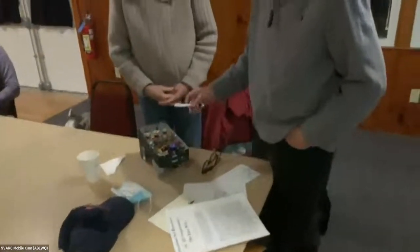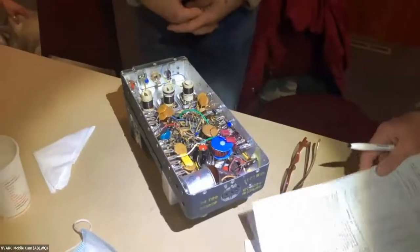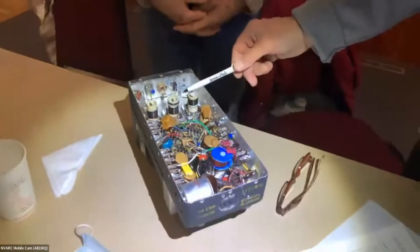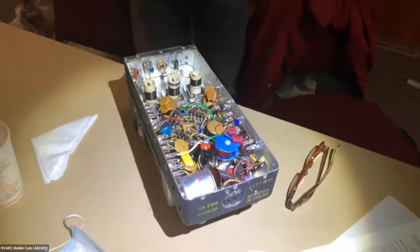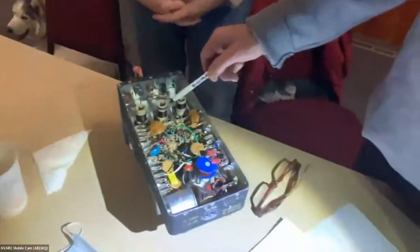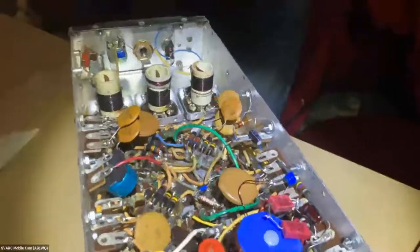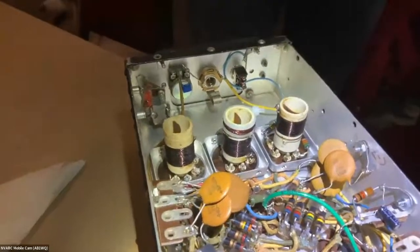The thing that really puzzled me was the RF coil. Initially this was a universal-wound coil — you can see that universal-wound coils have a honeycomb arrangement — and there was no way I had a machine to do that. So I said, well, inductance is what really matters. I used a couple of cable ties to form a channel and wound the same number of turns within it, and it came out resonating right about the right frequency. The original coils were wound with Litz wire, which kind of feels like a spring. That was the only universal winding; the rest were straight windings.